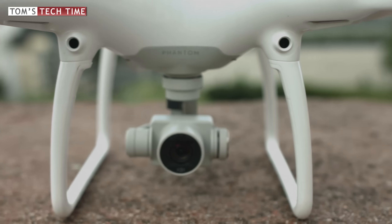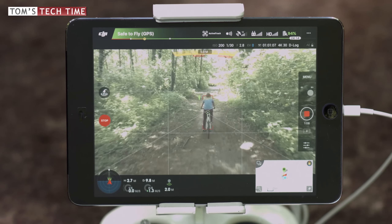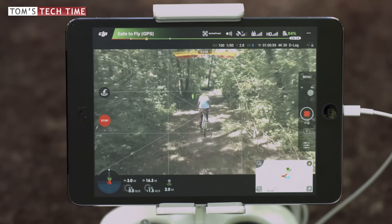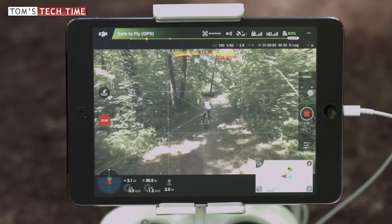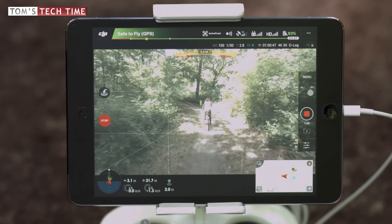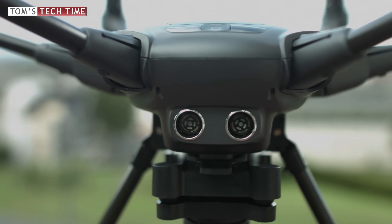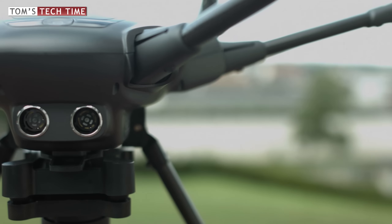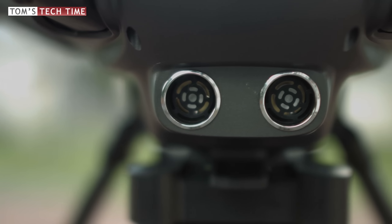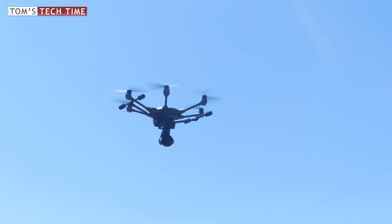The DJI Phantom 4 has two front cameras that can spot obstacles up to 15 meters. A colored bar notifies the pilot once an obstacle is detected, gets bigger and starts beeping the closer you get, and once too close the Phantom automatically stops and hovers. DJI's obstacle avoidance is also helpful during return-to-home — if you forget to set the correct height and fly toward an object, the Phantom 4 will automatically detect it and fly around or above it. The only con: the system only functions during daytime. The Yuneec Typhoon H has two sonar sensors with a range of 3 meters only — almost unusable as the stopping distance is too short. It only functions when flying super slowly, with no on-screen notification. Additionally, sound-absorbing surroundings like treetops can get the Typhoon H into serious trouble.